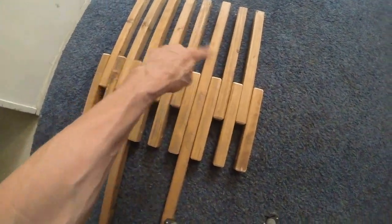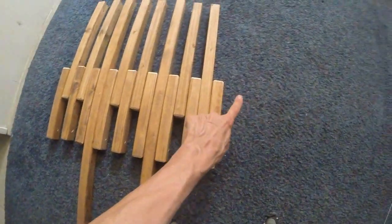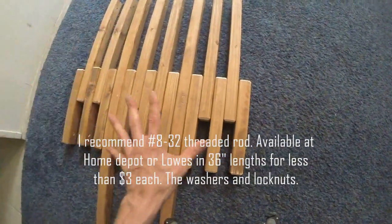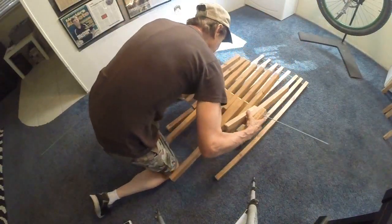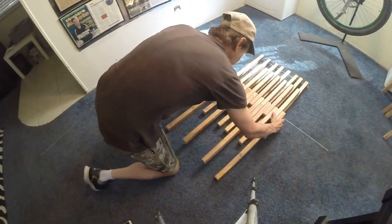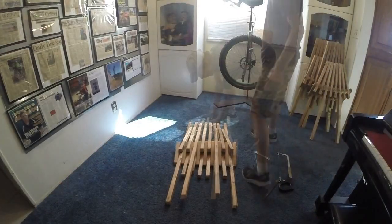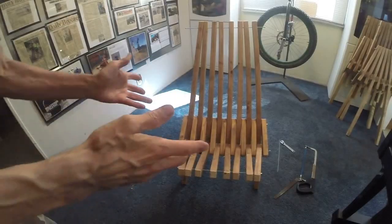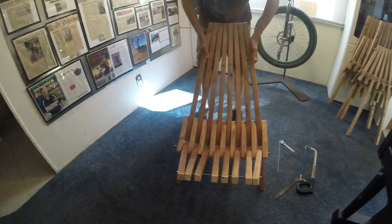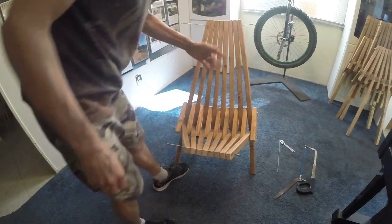Here are all 25 finished pieces — cut, sanded, drilled, and ready to put together. Now we put together the seat pieces; those are the 15-inch pieces, there are six of those. And all of our connectors — those are nine and one-eighth inches — and our back legs, which are the 35-inchers. We're gonna put a threaded rod through here and one through there, then lay this on top of the back piece. We lay the front seat and line up the holes for the connectors that go on the bottom. Let's stand it up — oh yeah, that's awesome! To complete it we're gonna push these together, and the bottom ones also together just like that. We'll tighten up the bolts and cut off the excess.